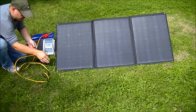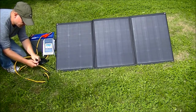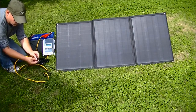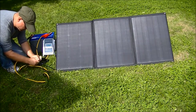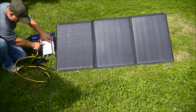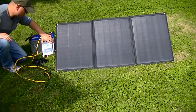Then I'm going to hook up my solar controller to my solar array. Now these MC4 connectors can at times be a little bit tricky — they're more of a permanent connection than a quick connect because they are waterproof. And that's it. The controller is saying that I have an array hooked up.